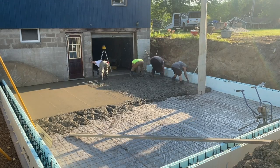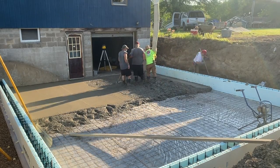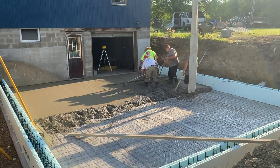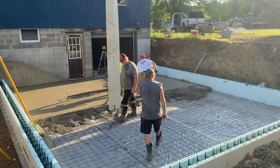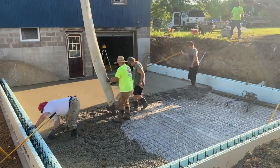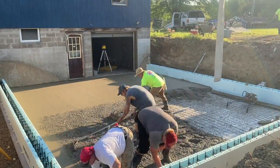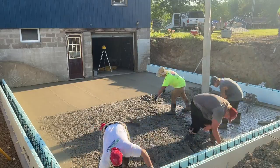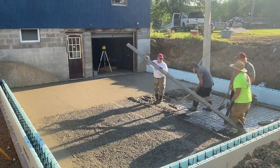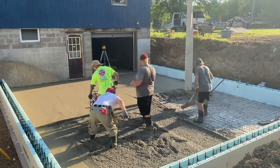This floor is about four to four and a half inches thick. We had one truck of concrete coming in. These trucks can only hold 10 yards, and we thought we'd get it with 10 yards. But at the end we didn't quite make it, so we had to get a little balance. We're dumping it right out here again, working our way down through. We got those hooks — Big Tuna in the gray shirt pulling up the wire with the hooks. We try to pull it up as they're dumping it. The aggregate gets underneath there so it stays up towards the bottom of the slab, just up like an inch.